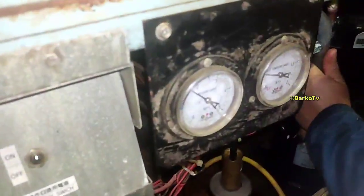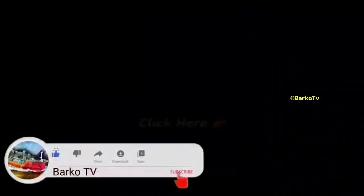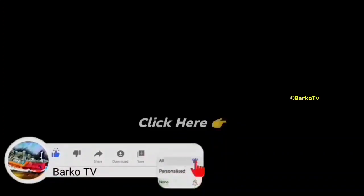This is fresh water coming from our LT cooler. Our evaporator starts to cool down — that's a good sign. But during running, almost 3 hours in, our system detected high discharge pressure. We need to clean the condenser in our next video. Please like and subscribe. Thank you for following us.